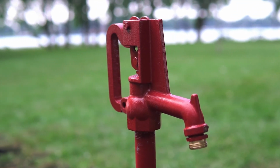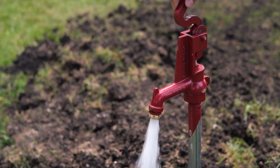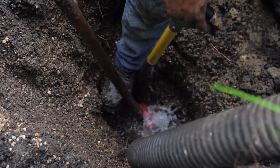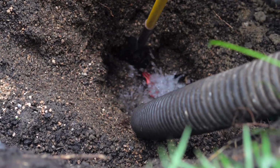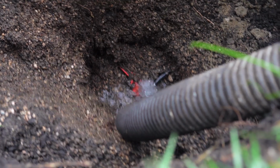In this video, we'll be showing you how to install our AnyFlow series hydrant. This procedure applies to the installation of all Merrill frost-proof hydrants. Dig up the old hydrant and remove. Prior to installation, flush the water line to remove debris.